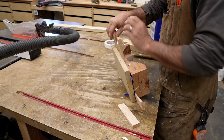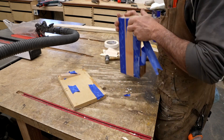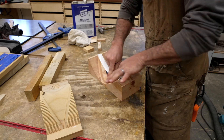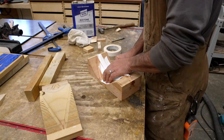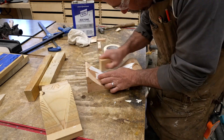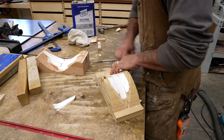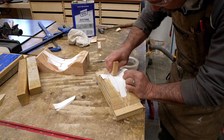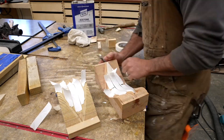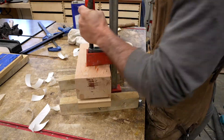At this point I could remove the mini spoil board from the workpiece — you just use a few wedges to get in between the tape and hammer it out. I cleaned off the jig and workpiece with a little bit of acetone to get any dust off. Then I put double-sided tape on both the workpiece and the jig, scraping it down as usual. Initially I tested it on only the workpiece but wasn't getting good enough adhesion — I could pull it off fairly easily. So tape on both sides ensured really good adhesion despite any misalignment.